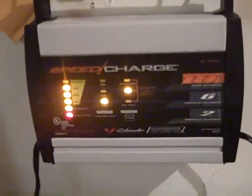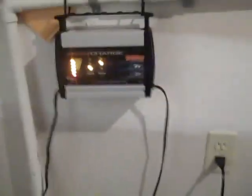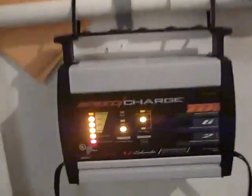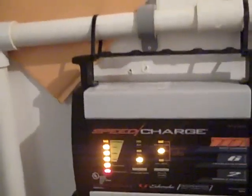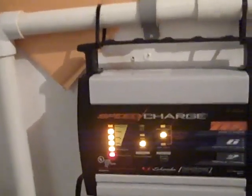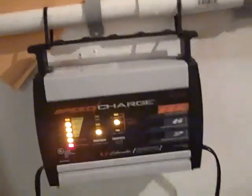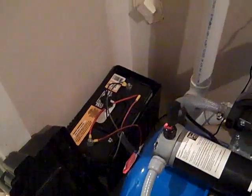This will eventually be replaced with a solar charger. We're going to put in one of these little Flex Charge solar battery chargers that you've seen before, running off solar. But for now we're charging the battery. This is a little speed charger that will run at 2 amps, 6 amps, or 10 amps, and you can set it for lead acid, AGM, or gel cells. That'll just keep them maintained because right now there's no other way to put power into the battery.